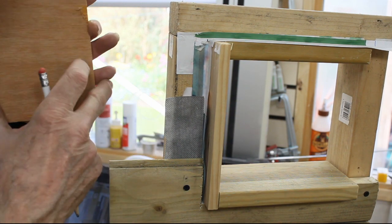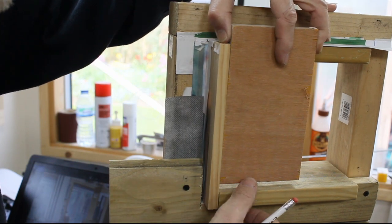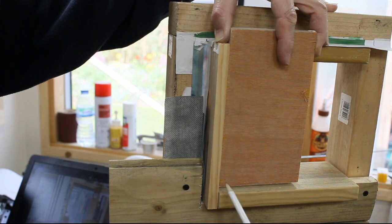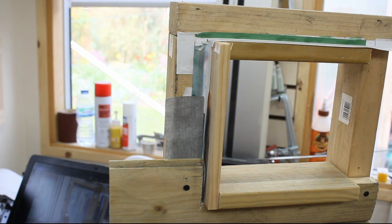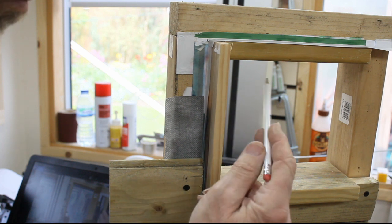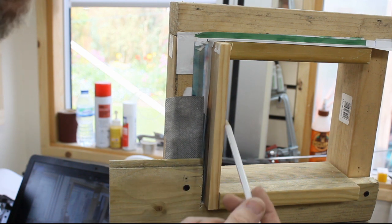The bottom sill was set at an angle so that where the windows were, because they're flush, any water will drip down them. But if it drips onto that ledge, it won't flow back inside the shed, because it's pointing down forwards. It'll drip off like a normal sill and just drop down the outside of the cladding. So I think the subframe has been suitably well sealed that nothing's going to get past that.